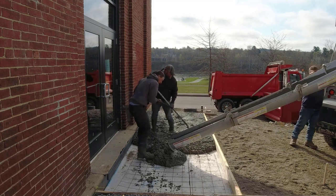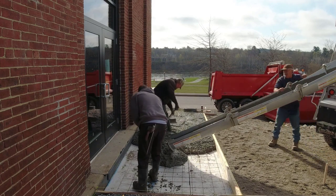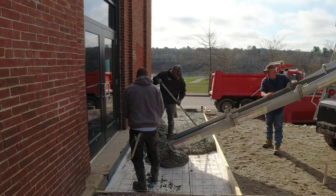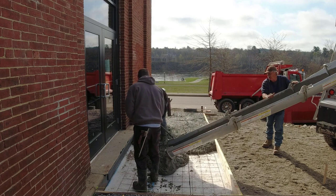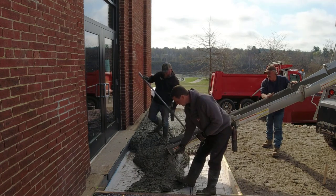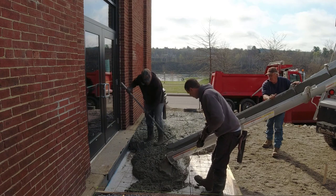You can see we're buttoned up against some old concrete on this building that had a kind of jagged edge — they didn't want to remove that piece, so they're going to caulk that after. In between this new slab and the old slab we've got some foam called iso strip. It's just a half-inch piece of foam, and the top half inch of that you can strip right off and peel it out afterwards. Then you can fill that in with a nice caulking so no water will get down in between the two.